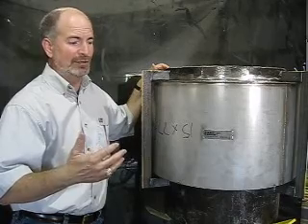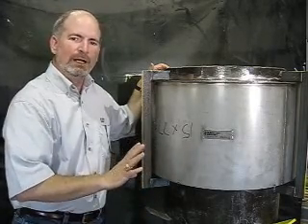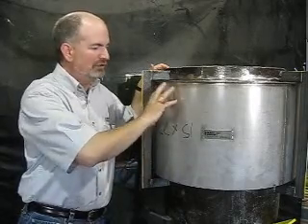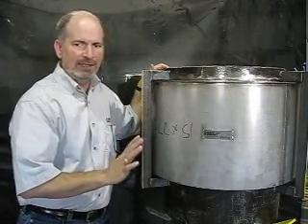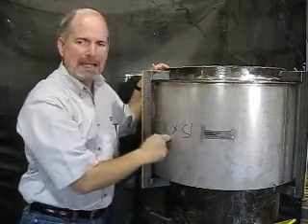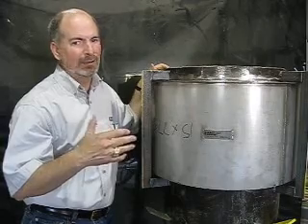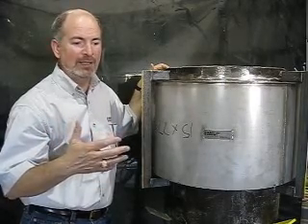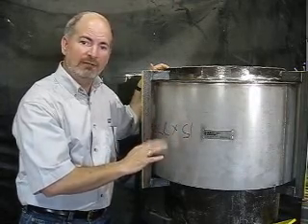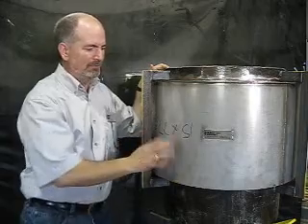You want to go back in with a heavier cover if these are original twenty-five or thirty-year-old joints, because a lot of those had covers that were really on the thin side — I'm talking sixteenth of an inch, sixteen gauge. We've seen missing covers and cracks all over these things. Minimum an eighth of an inch thick; three-sixteenths or quarter inch, if you can do it, is not bad at all. And put a liner on the inside with heavy covers on the outside. That's going to protect that bellows from resonating against that high flow, which is one of the few catastrophic failures on a bellows. If the cover gets dislodged and isn't thick enough, that bellows will succumb to the high flow and just vibrate itself to death.